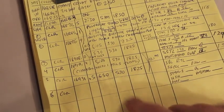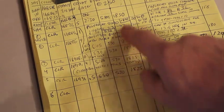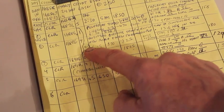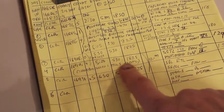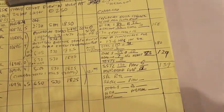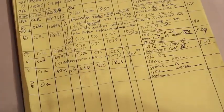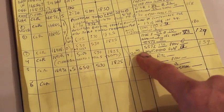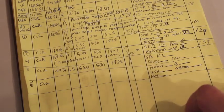I've run the furnace for several days now and gotten back into a routine of charging, cooking, and overnight idling. I keep track of kilowatt hours - in one 24-hour period it was energized for 11.3 hours, the next 11.4, and one day I cooked the glass an extra hour so it ran 12.1 hours out of 24. The side column shows items made: 129 one day, 180 the next. The main point is that 11 or 12 hours energized in 24 means I'm paying around $16 or $17 to melt close to 200 pounds of glass.